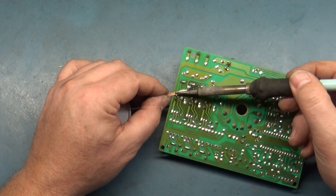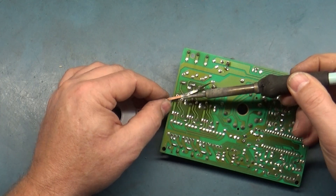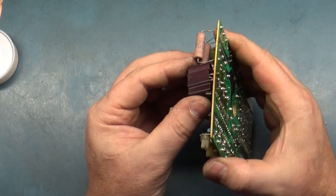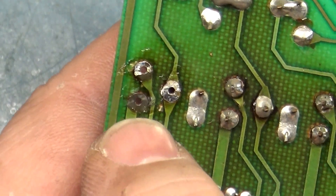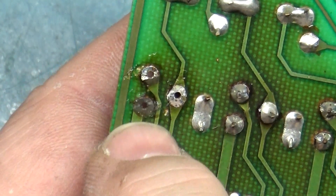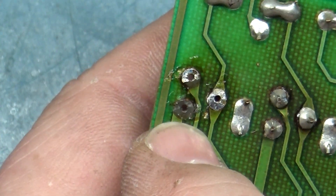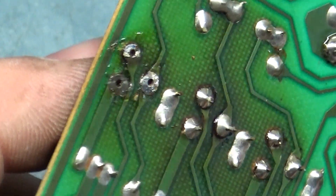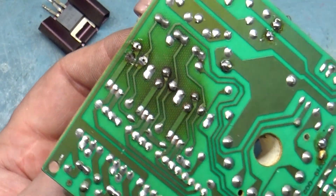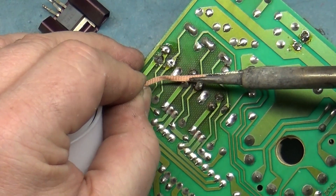The pad isn't broken, but it's so oxidized from heat that it wasn't even connected anymore. This is why I always like to take these out. Look at the pad — it is so oxidized you can't even see it. This is shiny from solder, and that's just black. That's because the solder joint wasn't any good to start with, which created heat and oxidized the pad, so there wasn't even a connection. That's why I always like to physically remove these and not just reflow them — simply reflowing them won't reveal that problem, and you'll end up back at color issues.